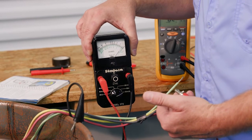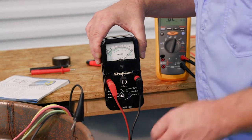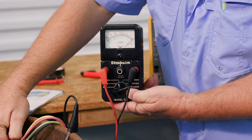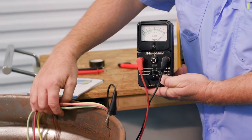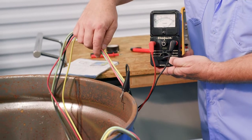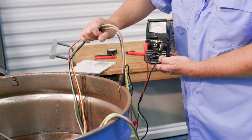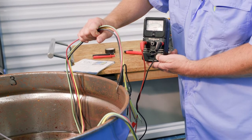The next thing we're going to do is leave the lead on the black. One of the things the manual talks about is, if you want to identify where the cut is, you slowly lift the wire up and you're looking for the needle. I'm slowly lifting that out of the water, and right about there — if I'm able to look in the barrel, I can find out exactly where that is cut, where that's nicked.